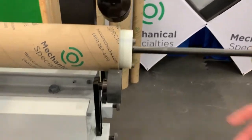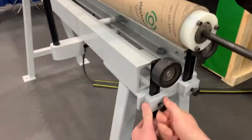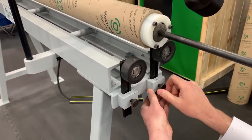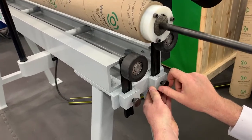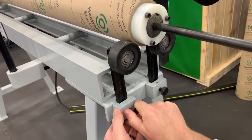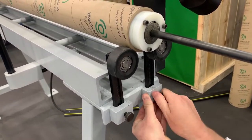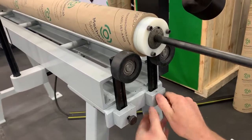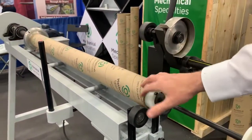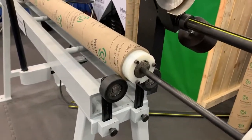This model also features two independent double rollers which add support and rigidity to the drive shaft that drives our core. Being independent, we can take these and if you have any runout or displacement of the drive shaft you can actually manipulate that by adding more pressure to one than the other. By having the two double rollers we create an immense amount of support that allows you to really guide the cutter right through the cardboard tube.